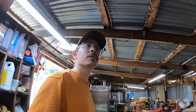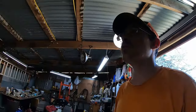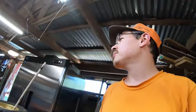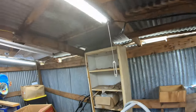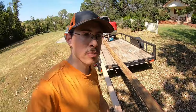I think that's going to work. I got all the lights burning in here and it's got plenty of light for what I need. Right now that side hasn't changed much, but this side of the shop is way brighter than it was with all these lights all the way down here. What might be nice is if I leave them all on and install a switch before the first light so I can turn them all on at once. I do want to fix this section with the rotted boards — probably scab a 2x6 in for those ones that are really rotted out at the end, and I'll probably end up repurposing this 2x4 I bought at the lumber yard to fix that spot in the shed.